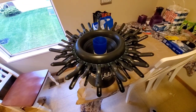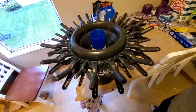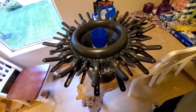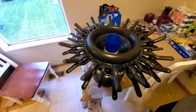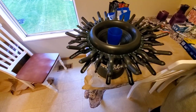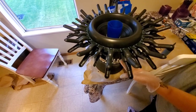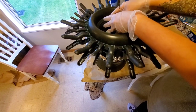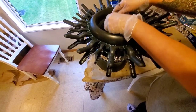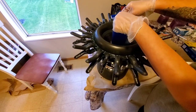So clamps are on there all the way around, and I will leave those clamps set overnight and just take them off in the morning and put the gasket down on it. But as far as the spider going, it's probably an okay time now to take the shims out and glue down the dust cap. So I'm gonna take those out.